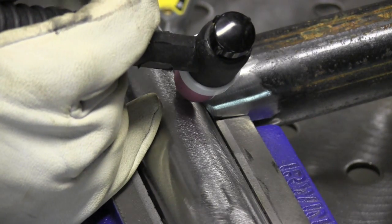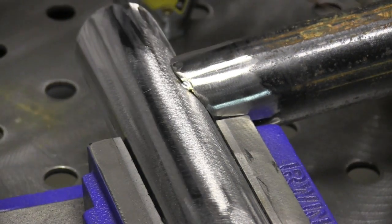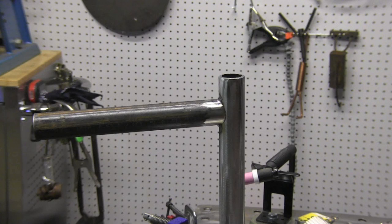We'll get another tack here and add a few dabs of filler. I want you to look at the tack when I'm finished — see how shiny and clean it is, nice and silver. The gas lens is doing a nice job, and that makes tacks nicer to weld over when there's zero oxidation on them. What I'm doing is stopping my torch hand while I'm adding filler metal — moving the torch ahead a sixteenth or an eighth of an inch, then adding a little rod while keeping the torch still. That way you're only doing one thing at a time.